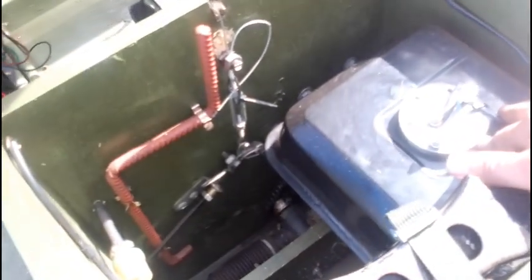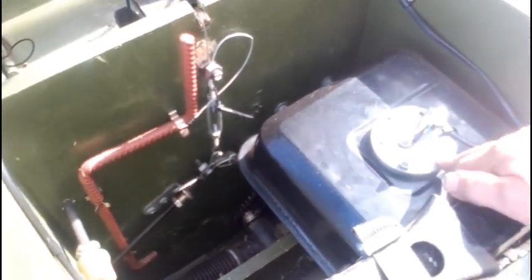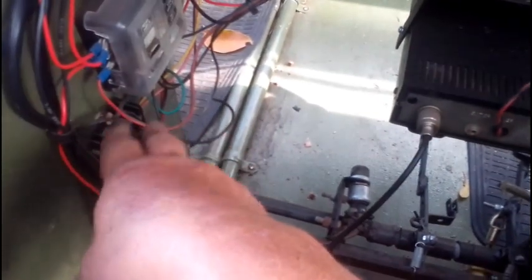Okay, so we've got fuel tank. So I've moved the fuel tank to the front here, and I've installed a bigger fuel tank, a 10 litre fuel tank with fuel tank gauge sender. All the wiring, we have a charge regulator from the motor to the battery, just controls the charge. Fuse box with accessories, the gauges.